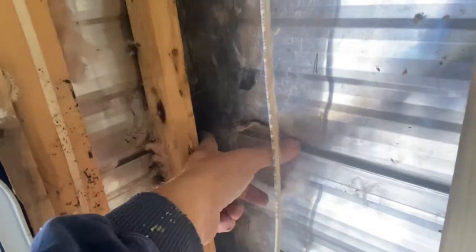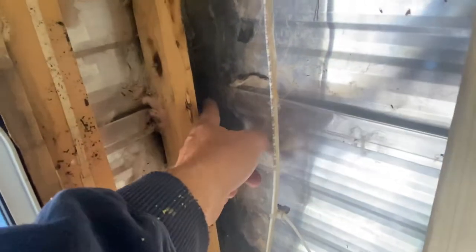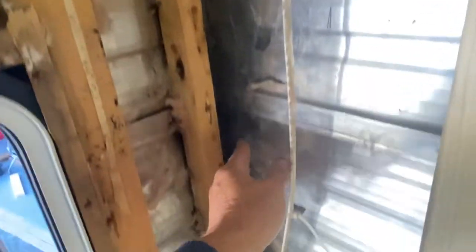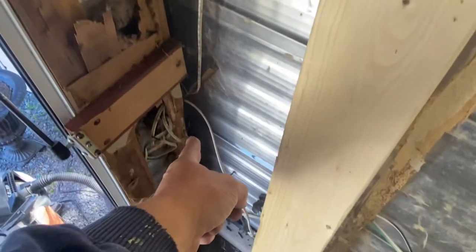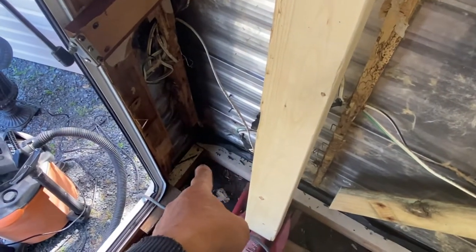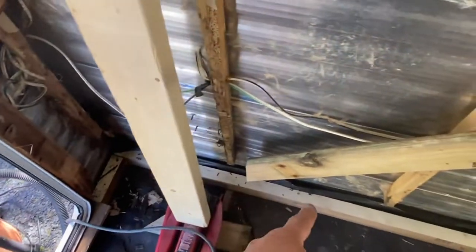That board's shot. I just need to pick all this out, take the screws out — there are some staples that hold the siding to that same corner board, so I'll snip those off. When I put the molding back on with fresh new butyl, that'll be nice and tight and keep the water from coming in. That same board and studs will sit on top of this sill.